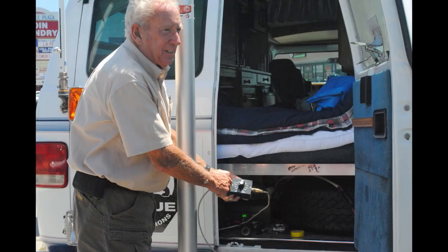generally, once you find the sweet spot, you won't have to touch that antenna matcher again. It'll work 10 through 75 meters, at least 10 through 40 meters. On 75, yeah, I've got to give it a little bit more inductance, but 10 to 40, it'll roll right up.